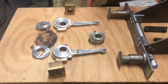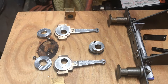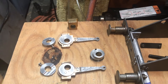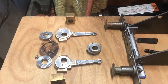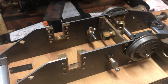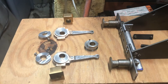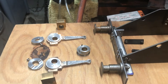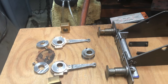Here are the finished eccentrics. I polished them up a little bit with the Dremel — they feel very solid, so I'm pretty happy about that. We'll give them another test fit on the axle and make sure they fit into the valve actuating rods. I'm thinking about using gun blue on them — I'm not quite sure, they're going to be coated in oil in operation, but the gun blue would look good and protect the steel part from rust a little bit.